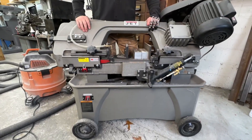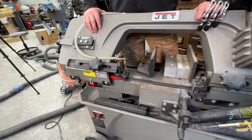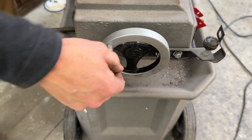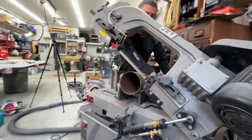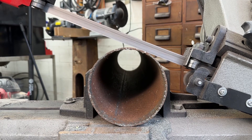If you really want to step up your metal cutting game, you might be interested in one of these horizontal metal cutting bandsaws. It has a pivot point in the back and you can raise the head up. It can be a little intimidating because there are a lot of levers and switches to make it work correctly. The price ranges between $1,000 and $2,000 — this particular one was $1,500, made by Jet. I chose this saw because it was one of the largest cutting capacity saws in that price range. They make ones that miter with a tilting head, but they're smaller for the same money or you're spending $10,000. I went for the biggest saw I could get for my money that does basic cutting: 90 degrees or 45 degrees.